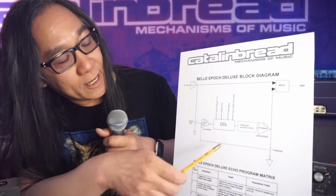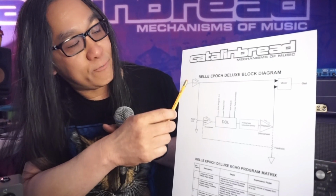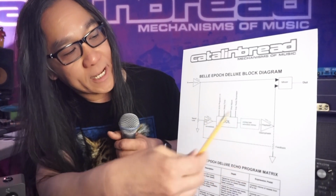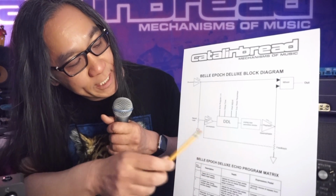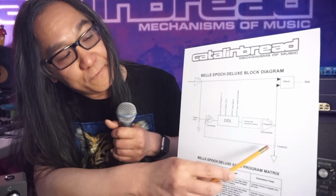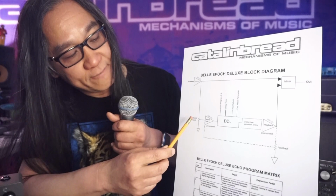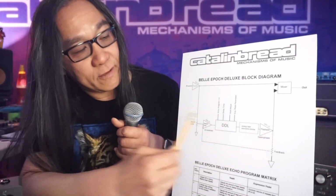So you notice a couple things from this circuit here. It doesn't go back into the preamp. So the preamp is only your first time you play this, your guitar. But as it repeats through, you know, the first, second, third, et cetera, repeats, it's only in this loop. And the other thing you notice is that the record level does not inform that loop how hot the loop is. The feedback or echo sustain control is what does that. So that determines how hot this loop is. The record level just sets how hard your guitar signal initially hits the loop and feeds into it.